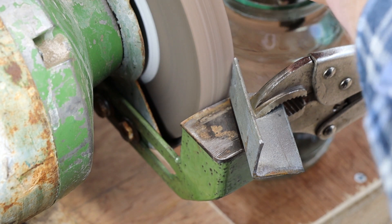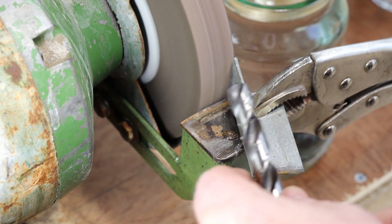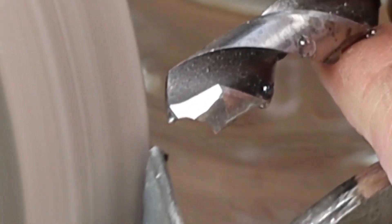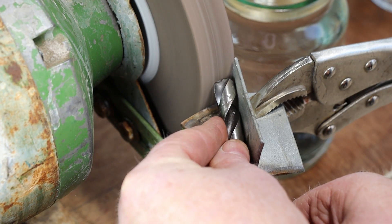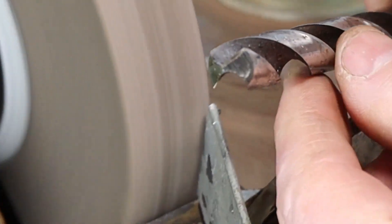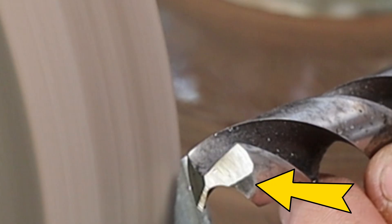It's important to use the water regularly to keep your drill bit cool while you grind it. I'm also using this touch-and-go method to try and minimise the heat build-up. We don't need to remove much metal to change the point angle, so it's a fairly quick process. If I zoom in here you can see that the cutting edge looks good, so now we need to grind the relief angle. We do this by lifting the drill bit's point up from the tool rest at about that same angle we measured earlier. After a few grinding and cooling cycles, we need to grind this side a little more until this line meets the cutting edge.